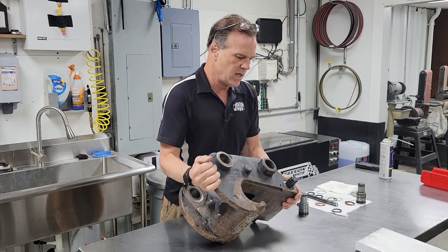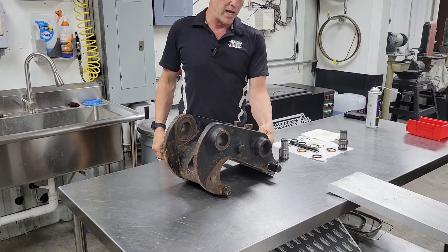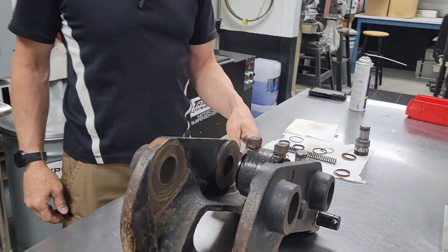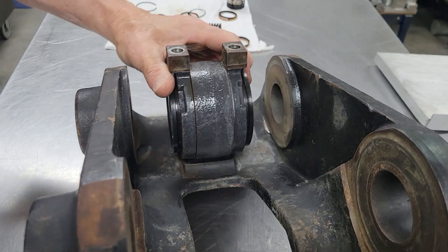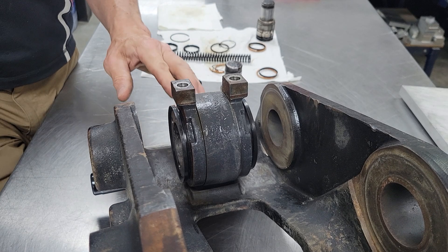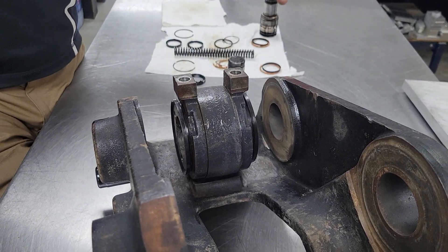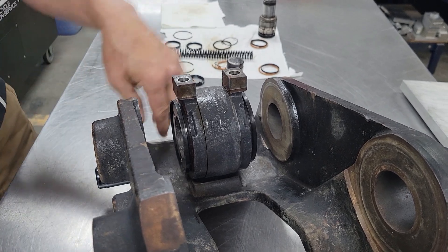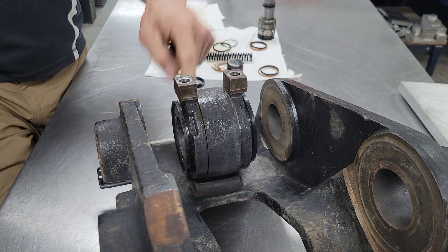Lastly, the swivel unit. I did replace the O-rings in that while I had it off and apart. I cleaned it. This is a whole different assembly and a whole different monster to rebuild — I'm not going to go into that. But there are two O-rings, a smaller and a larger one under here. Make sure you buy those and take this off while you're doing this job. You have to spray through all those passages to make sure there's no grit, no dirt, no debris. Change those two little O-rings while you're in there — it's just smart money.